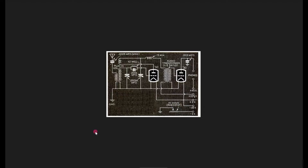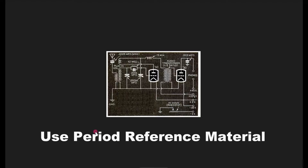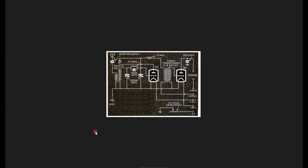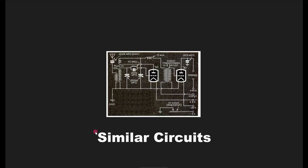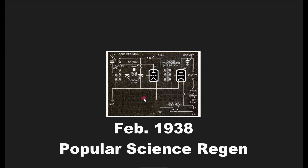When you're trying to figure out a circuit from scratch, it's a good idea to have a schematic in mind that you can use as a reference. It gets you started and gets you thinking about what was done at the time. I found a schematic that used Type 30 tubes — it's a late 30s, 1938-39 style battery regen. I wanted one that used circuits from the 1930s rather than something more modern.